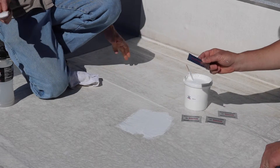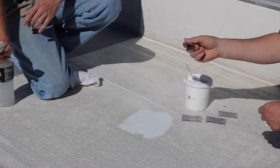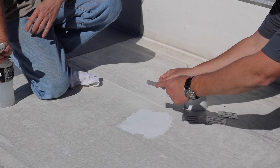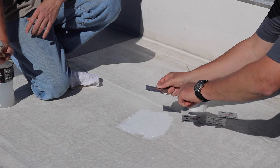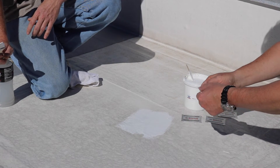What we're trying to do here is just measure the amount of coating that's on the roof, and as it touches these teeth we'll know that. The easy way is to look at where the coating is actually touching on the tooth. As you can see, that one's all the way up to 30 mil — we've got it on there quite thick.